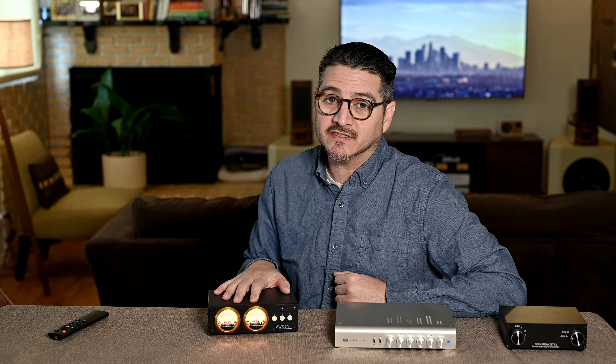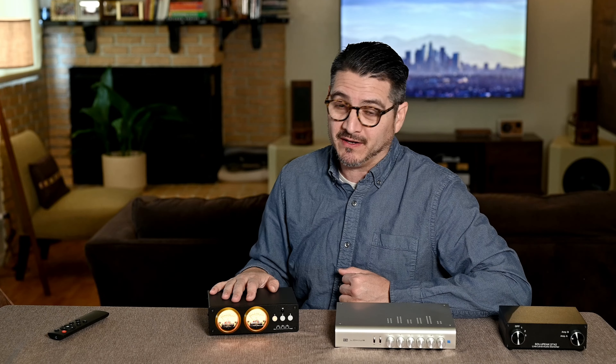If you're looking for a way to integrate an EQ, this is awesome. One heads-up though: if you're working with an integrated amplifier that does all its processing internally with no send-return loop, this won't be useful in that aspect — that's one of the downsides of integrated amplifiers, you're locked into what's built in. There are a few out there with a send-return feature, which is great, but it's something people just aren't asking for so manufacturers aren't adding it. Doak also has a unit without the loop feature that just has RCA ins and outs — I'd suggest jumping up to this L3 for a little more money. It's well worth the upgrade.